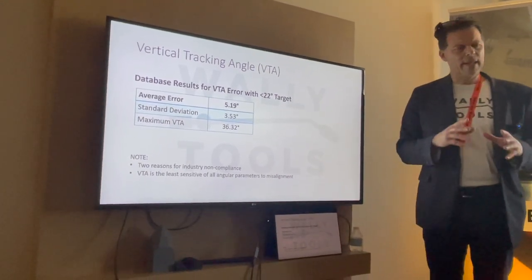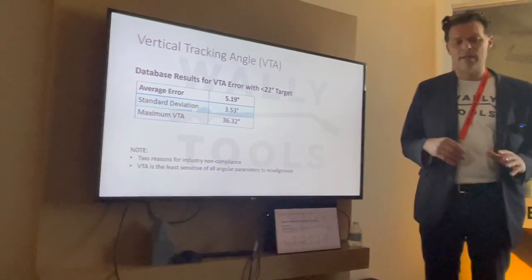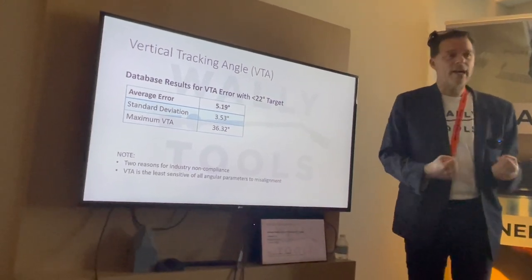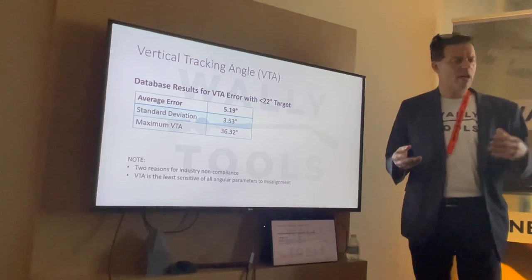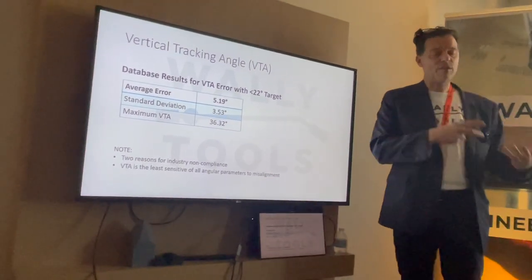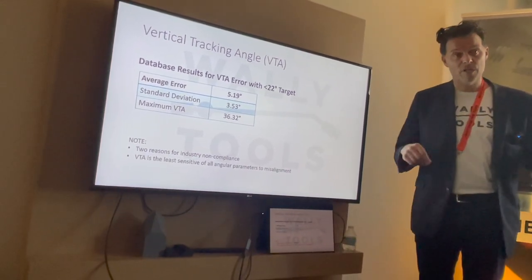And they're very adamant that if it's a good cartridge, it will track at the 80 micron or 90 micron, whatever, test tracks. Now, no responsible engineer is gonna cut at these amplitudes. They're crazy. They're really out there. But for whatever reason, the audiophile press has used the test record tracks as a measure for how good a cartridge is.